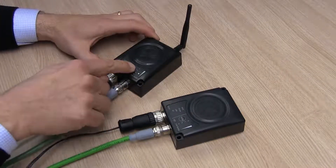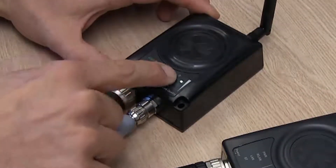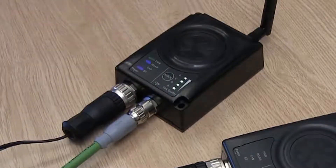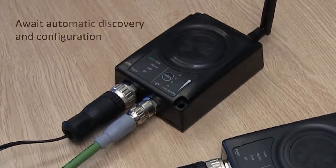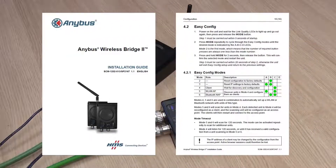On the first module, I press the Mode button until the C LED is lit and then hold it for two seconds to confirm. This means that this unit should go into a mode called Await Automatic Discovery and Configuration. A list of all ECConfig modes and their pressing sequences can be found in the manual.